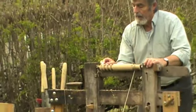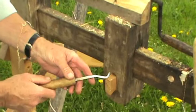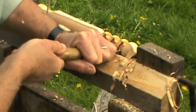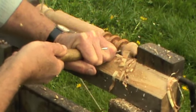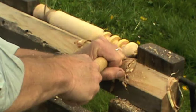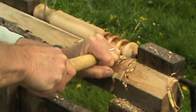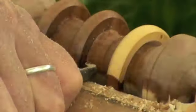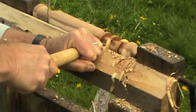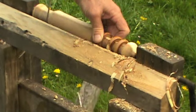A little dab of oil on each ring before they're separated from the rest of the rattle. This device here is called a ferret, which is a scraping tool to undercut each ring — firstly on the right and then on the left — hoping that the two cuts will meet. If they meet successfully, the ring is liberated. Repeat this with the other two rings until they're all rattling happily on the core of the rattle.